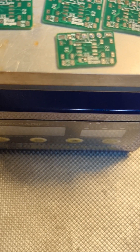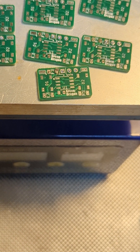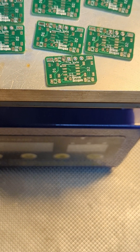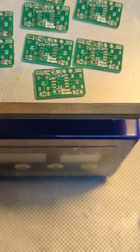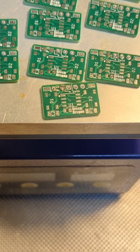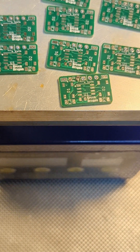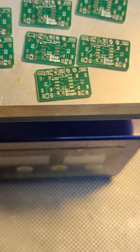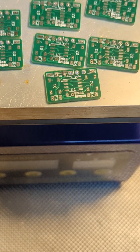I'm back in the workshop and I'm putting together a few of these little boards, which are basically a little 8-pin microcontroller, two addressable LEDs, a resistor for the data line for the LEDs (R1), a bulk capacitor for the board (C2), a tiny 100 nanofarad decoupling capacitor for the microcontroller, and a fuse — which I'm not going to populate. I'm just going to put a zero-ohm jumper on, because the battery pack is going to run these. They're going to run off those little disposable vape batteries — I'm going to reclaim a load of those and use them to run little rechargeable lights basically.